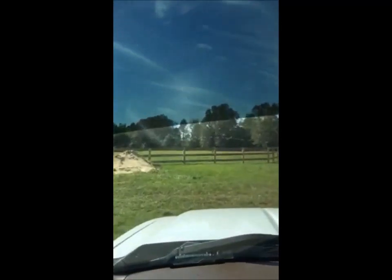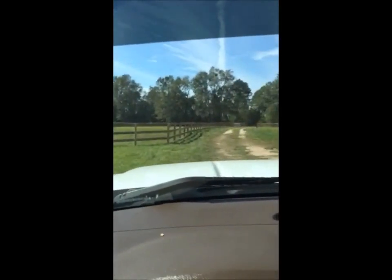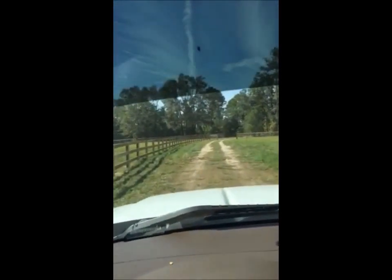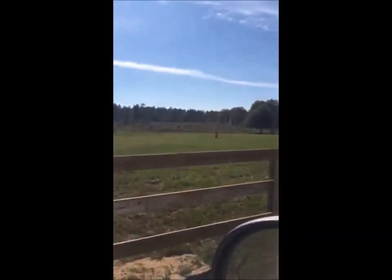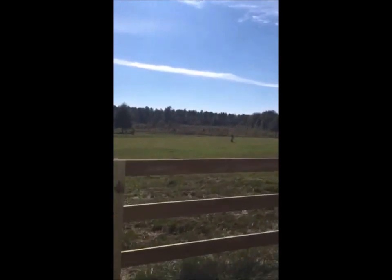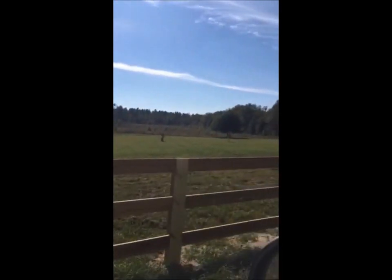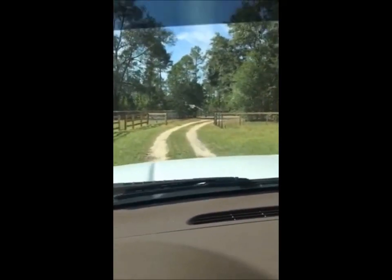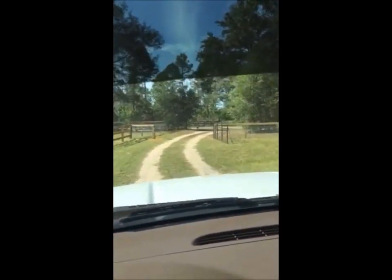Here we have another three-rail running back out to the road. On the back side there'll be another driveway coming in, and on this side of the property there's an existing hot wire fence further up that we didn't extend to. We get around here to another 16-foot gate that heads out to the driveway. I'll show you this run on the perimeter — the 48-inch no-climb with a corral board on top.